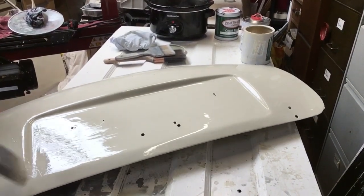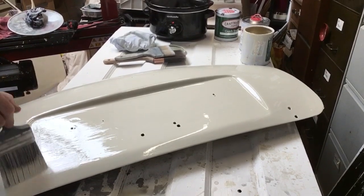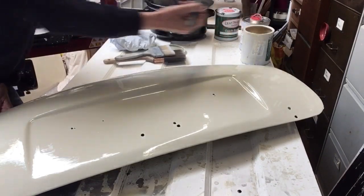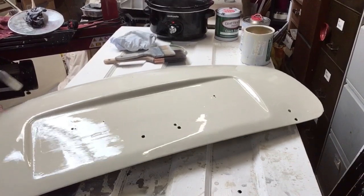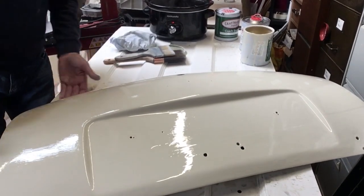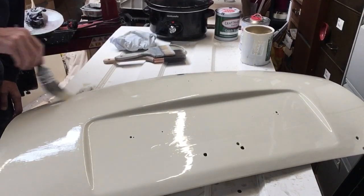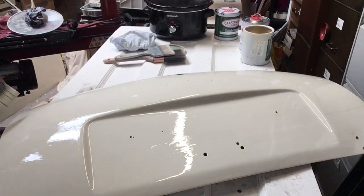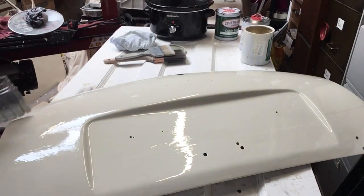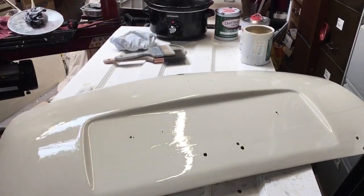Leave it well alone once you've applied the paint. You can't go back onto the front edge where you've already started — you've got to keep a wet edge and you can only go to the wet edge. Just smooth the edge off there. As long as you spot any missed areas before you call it a day it's not so bad, otherwise you'll be kicking yourself later. I've got lights on here so you can see what I'm doing.